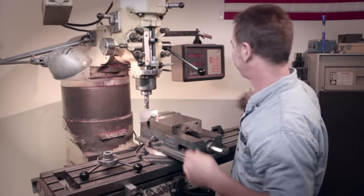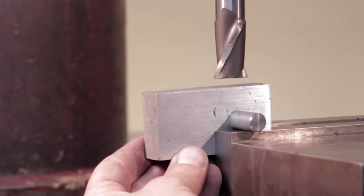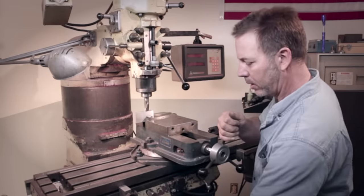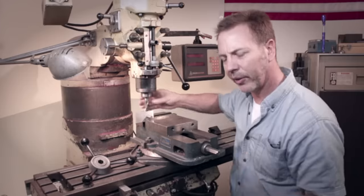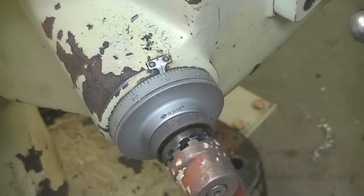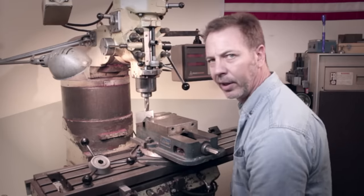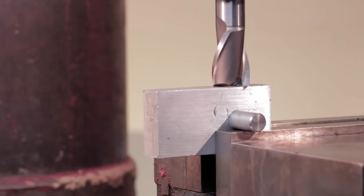So let me show you how you do this. First, we have to line up the part so we know that the cutter is right on this edge. See how this is just kind of loose? If I go in with a cutter — especially like a two-flute cutter — I just lower the cutter in it and it's set. We tighten the quill, tighten the vise. Now we're going to be a little too tight from what I want to do, so we're going to lower the knee down. We're going to center the dial, put it on zero. We're going to lower the knee, take out the backlash, come back up, and stop about two thousandths right before zero. Don't forget to turn your handle around — the weight of the handle can vibrate and cause your knee to lower and we don't want that to happen. Now we've got about two thousandths of an inch clearance and we can start cutting.